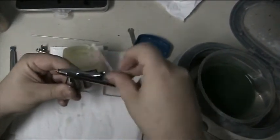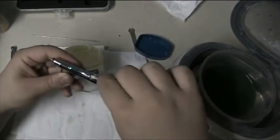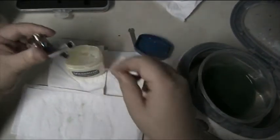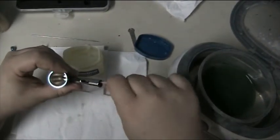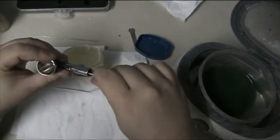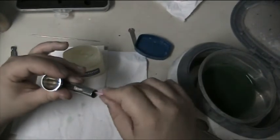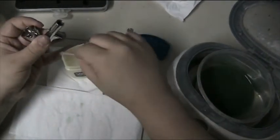solenoid. In the event that there is any paint leak that has occurred by a beginner using it and pulling the needle out while there's paint present inside, the lubricant will catch the paint as well as not allow metal on metal to rub against each other quite tightly. When you have metal on metal and there's just the tiniest amount of paint that gets in there, it's going to completely seize up and not want to operate and glue it together a lot like an adhesive.